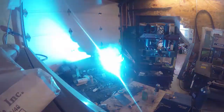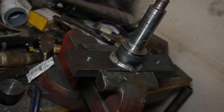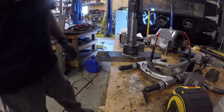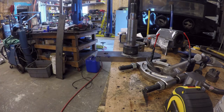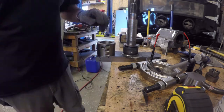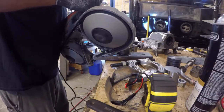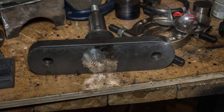If you're wondering why we're so far away, I didn't want to hurt my new GoPro. Now I think this is looking sharp — a little too sharp. Let's knock off those corners. I first apply marking fluid and wait for that to dry, then I use a round piece of steel to mark out the radius. With a bandsaw I cut the corners, then finish up the radius using a belt sander. And the Swing Link arm is done.